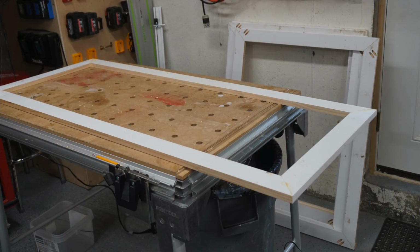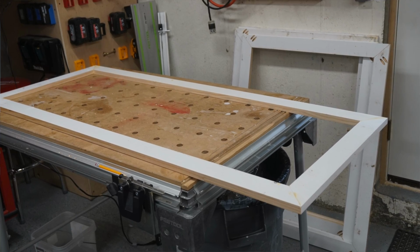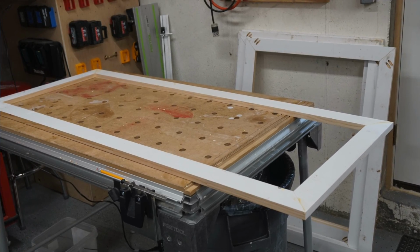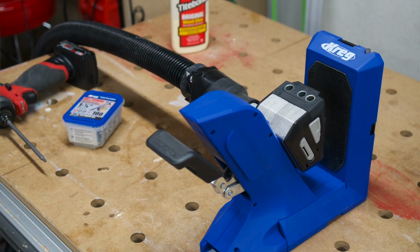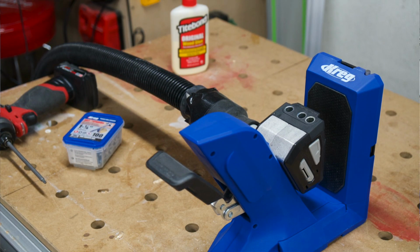Over the past few years of doing carpentry, I've had the opportunity to both install picture frame miters in place, one piece at a time, as well as pre-assemble it on a table and put it up as one piece. I don't have to tell you that pre-assembling is always way more accurate, and it's going to result in much tighter, nicer miters, and an overall more professional looking product. Now, I try to pre-assemble my trim when I can, and I use a Kreg jig with self-tapping panhead pocket screws to get it done.